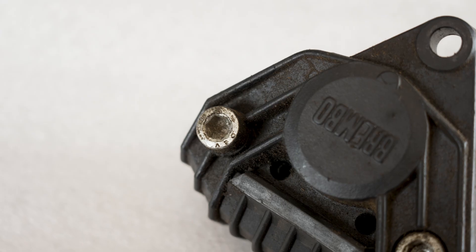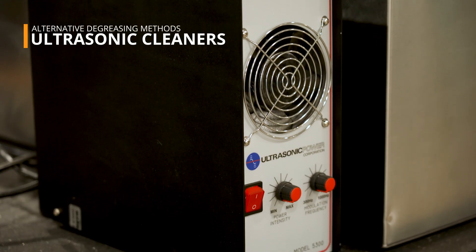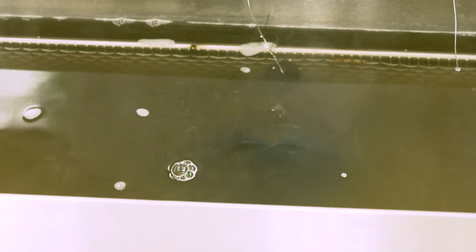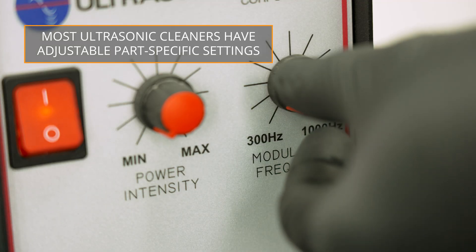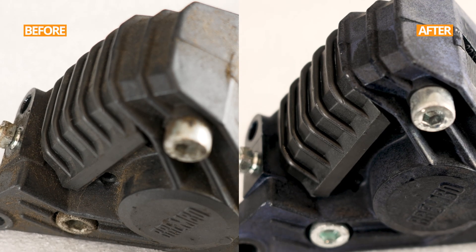Our third part has a hardened layer of difficult-to-remove buildup. You can resolve this with a longer soak and some elbow grease, or call in the big gun. Ultrasonic cleaners are a common tool for removing buildup in hard-to-reach areas. They use a high-frequency sound wave to loosen debris from the parts, providing an effective and efficient degreasing process. Ultrasonic cleaners can be designed for water or solvent-based degreasing agents depending on the model. Most will have adjustable water temperature, cleaning cycle duration, and sound wave frequency settings depending on the material being cleaned. Make sure you refer to the owner's manual for more information.